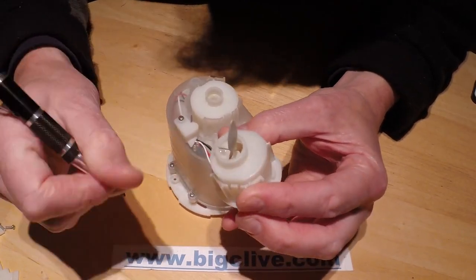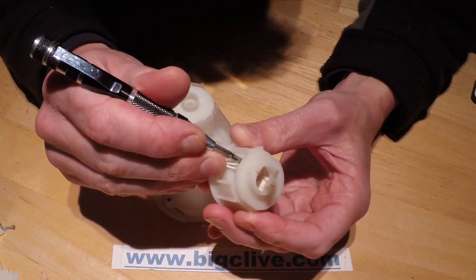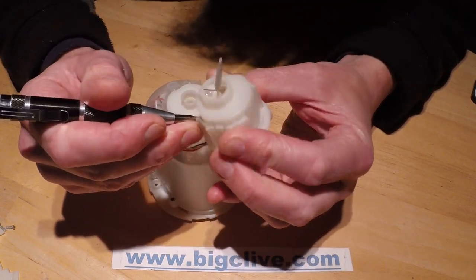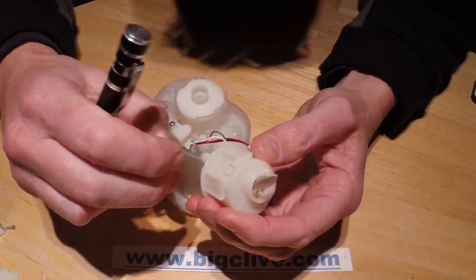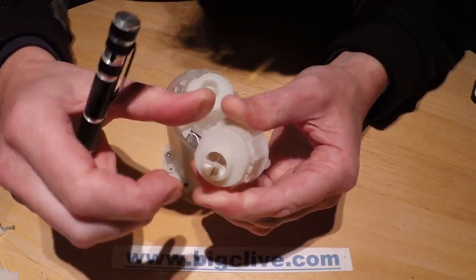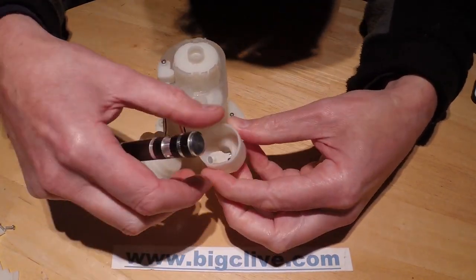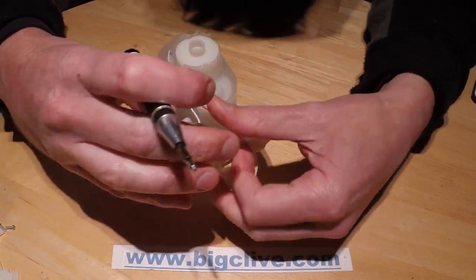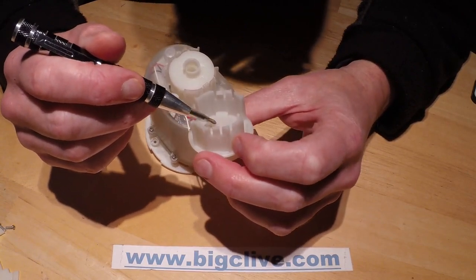This being waterproof, I can see the LED that points up at the flame — the flame is lit from the front with an LED. It's all sealed around the base with what looks like epoxy resin, possibly hot melt, to make it as watertight as possible. They've also sleeved the wires, which is quite neat. That part unclips, revealing underneath a small counterbalance and a little neodymium iron boron magnet — I'm guessing neodymium iron boron because it's quite powerful. This is the deflection module, and you can see there's a weak coil off-centre, probably to keep it roughly centred under the magnet.